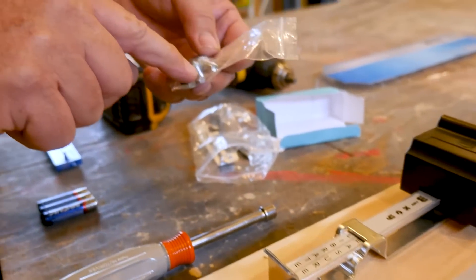Use your 7 millimeter nut driver to drive the screws in. Very nice — that is very much a fix there. Now reinstall the scale back in, push the spring back over, lower it partially in, put the display head back on, and slide it down until it goes to the front groove and rides freely. Grab the spring from the back, pull it out, rotate the head slightly, and put it around there. For the DeWalt DW735, use the supplied bracket plus the double washer, and attach them back on with the original screws from the indicator. Leave them loose so they're easily adjusted.